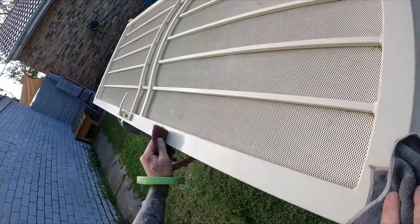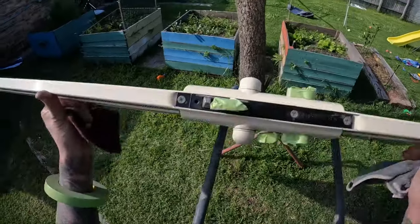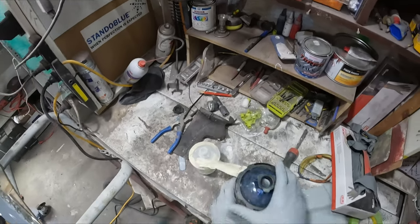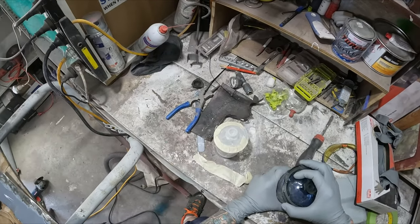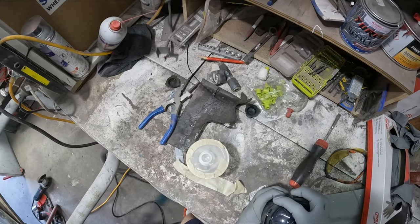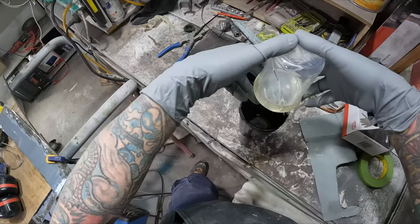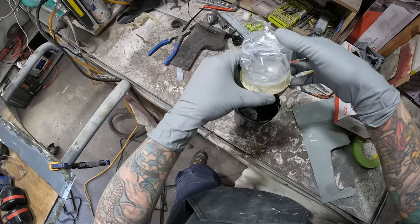I'll give this one final wipe down before I start painting just to get the bulk of the dust off. I guess I'll do the inside first because that way the final finish can be on the outside — flip it over. We're about ready to start painting. Just because it's water-based doesn't mean it's not toxic, so we still do want to wear a respirator. It's nowhere near as bad as your two-pack paints, but still don't want to breathe too much of it in.